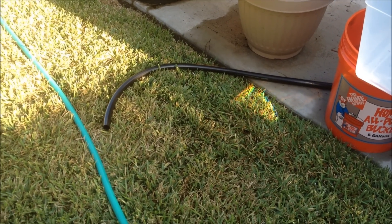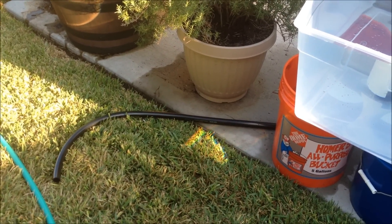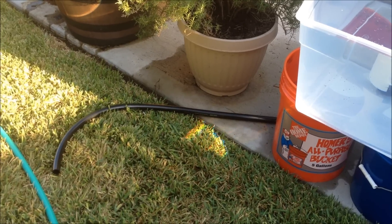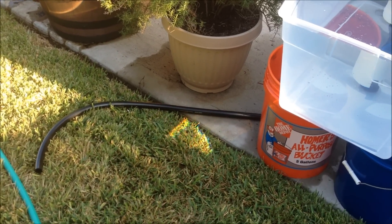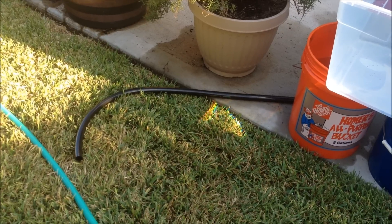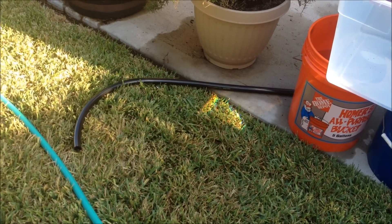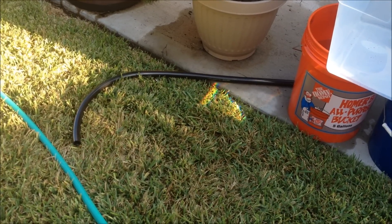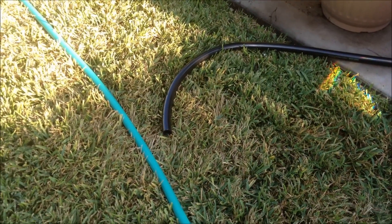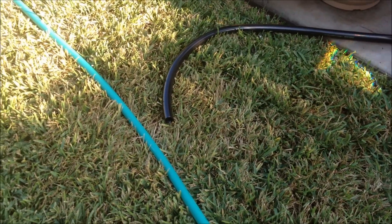If I cut it too short... there's about an inch or close to two inches. The inside standpipe was a little under eight inches and I cut the bell to ten and a half. I did shave a tiny bit off the bottom, but it shouldn't be so much that the air can't get out of there. I'll have to recheck that — maybe I cut too much and just didn't realize it. Looks like we're getting a little trickle there; water's starting to come out. Hopefully that'll settle my bell down too.